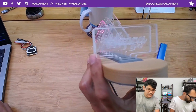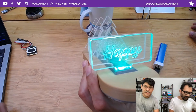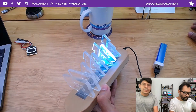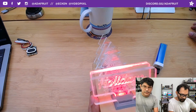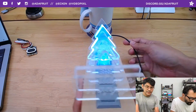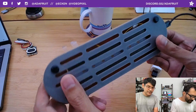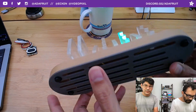Some folks had some fun ideas on Instagram. They're saying you could do a scene from Super Mario, from your favorite game. I've seen a lot of lithophanes that are multi-layered lithophanes, or some geometric animations, like seamless loop GIFs. Imagine those etched out in here. If you wanted to bring the LEDs tighter together, you would use a different NeoPixel strip. This is just the 60-LED-per-meter one, which is a medium density. You can see it right in there inside that little groove.